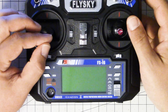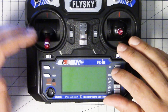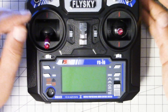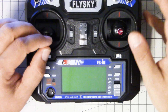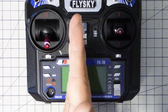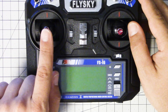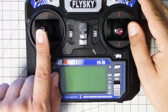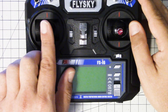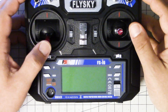It'll be like having a car where you couldn't push the accelerator pedal all the way down, or couldn't push the brake pedal all the way down. Likewise, if the channel goes too far, the endpoint the flight controller expects needs to match what the transmitter is sending. The center point also needs to match; otherwise the flight controller will think you are deflecting the stick when you're really not, and the quadcopter will constantly be rolling to one side. This is a basic setting I verify on every single copter I've got.